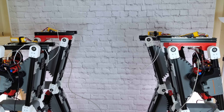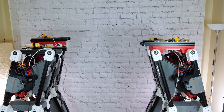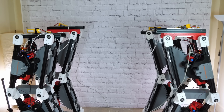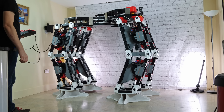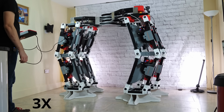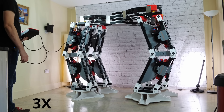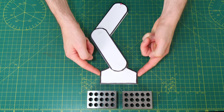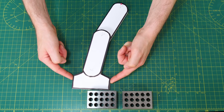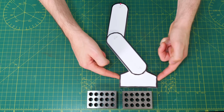As the AT-AT only moved forward with one foot at a time, that foot went forward as fast as it could with the other three legs moving backwards, and the velocity of those three legs had to be around three times slower so that there was time for each foot to take a step forward in turn. That meant we were actually moving forward four times slower than the maximum speed the feet could have moved. The AT-AT also had limited stride length because the legs could only bend so far, meaning there was a limit to how far it could reach to clear the ground with each step.